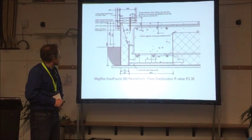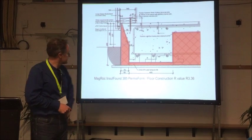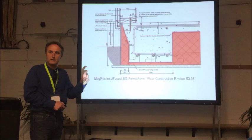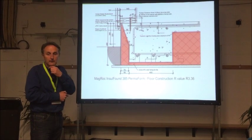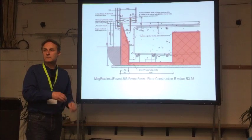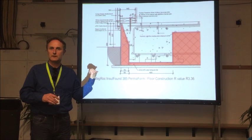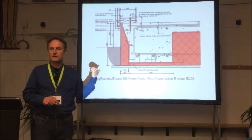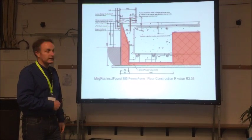The slab. This is a drawing which shows the slab — the red is the insulation. In most houses, if you're lucky, there's a 50mm bit of polystyrene under the slab. There's nothing under the edge and there's nothing at the edge. Critically, 80% of the heat is actually lost out of that edge, because the ground temperature is more constant — it could be 8 degrees, it could be minus 5 in Dunedin outside. The heat finds its way to the weakest link, which is that edge.